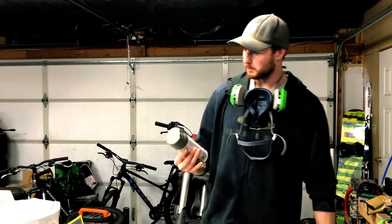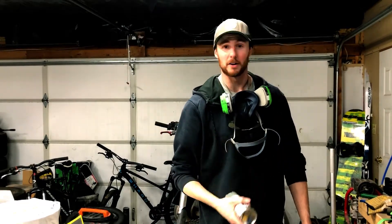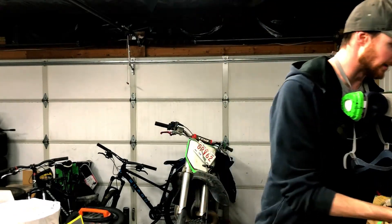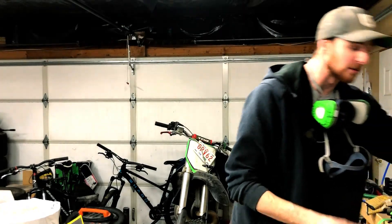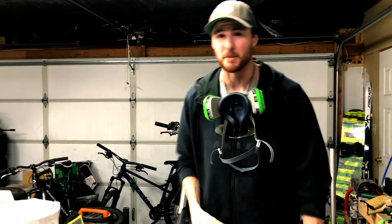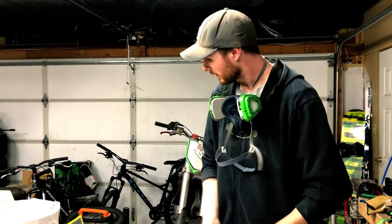I'm ready to spray here. I'm just going to be spraying some self-etching primer from Rust-Oleum. I am mix-matching a bunch of different products — got Rust-Check for my matte black and Dupli-Color engine enamel for my green. It's not ideal, but this isn't going on a car and it's not going to be exposed to any elements. One thing to remember: always wear a respirator. I'm just going to be wearing my charcoal filters. Keep in mind if you're spraying a two-part paint or clear primer, charcoal filters won't filter out all the isocyanates — they will filter out your VOCs, volatile organic compounds, but not all the iso. Just something to keep in mind.